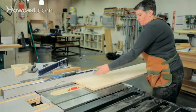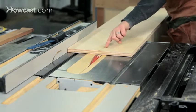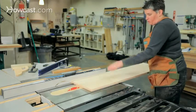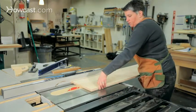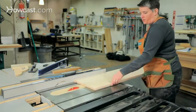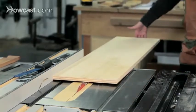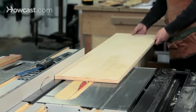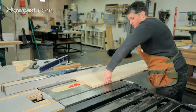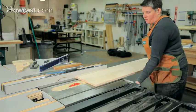The idea of ripping is that you're pressed up against the rip fence — that's what you're indexing off of to make your cut. So this edge has to be straight; there's no way to do this cut safely if that edge is not straight. With that straight edge against the fence, your left hand is positioned up front pushing into the fence and holding down, while your right hand is behind, pushing the board forward through the opening between the blade and the fence. This technique of holding the board against the fence while pushing is key to preventing kickback.